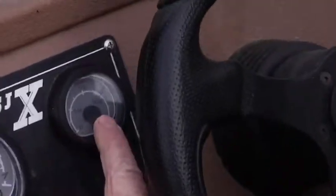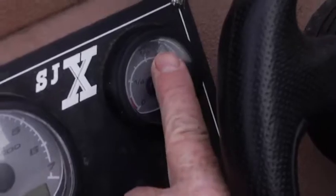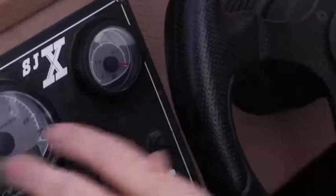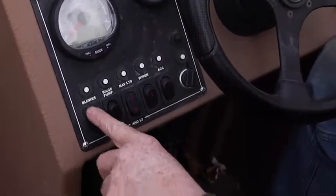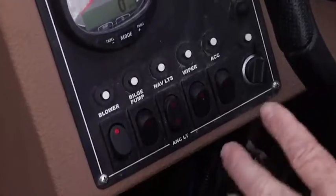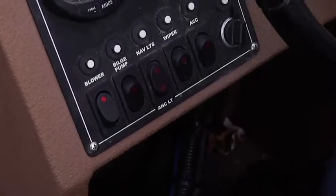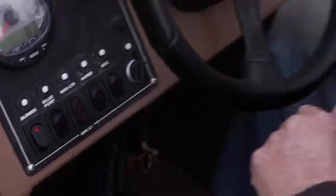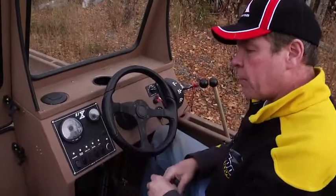You have an analog fuel gauge which matches your fuel percentage gauge. These tanks are 40 gallons, so at half a tank you have about 20 gallons left. Before starting the boat, you should always hit the blower — you'll be able to hear it run. Your blower removes any fuel fumes from the engine compartment. The Coast Guard recommends you run it for five minutes before starting. When I arrive at a boat launch, before I even take my tie-downs off, I reach in and hit my blower.